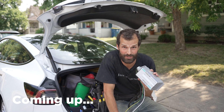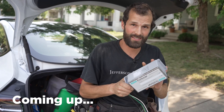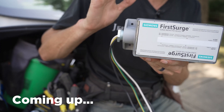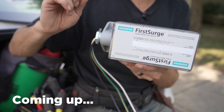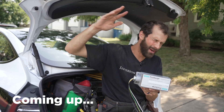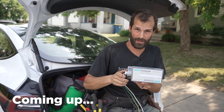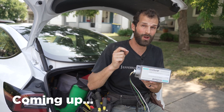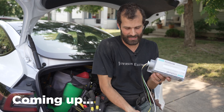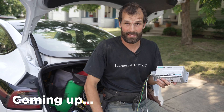Hey, it's Joel Walsman, CEO and Master Electrician of Jefferson Electric. I've got one easy job to finish off the day. This is a Siemens FS140 surge protector. This is top-notch for residential surge protection. We've got one unit we charge $2,000 for that's the creme de la creme, but this bad boy is much more affordable and still super robust protection. That FS140 stands for 140,000 amps of surge protection — that's fantastic. In addition, it comes with nice three-foot leads. Let's put this in and wrap the day up.